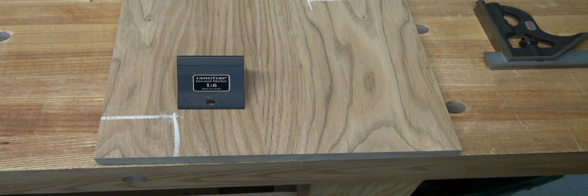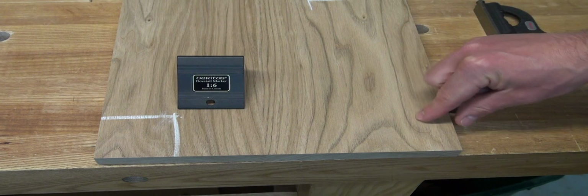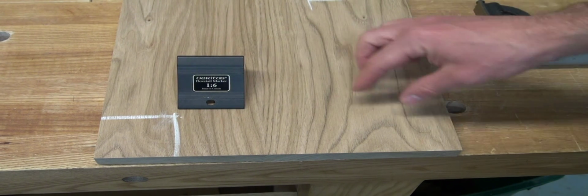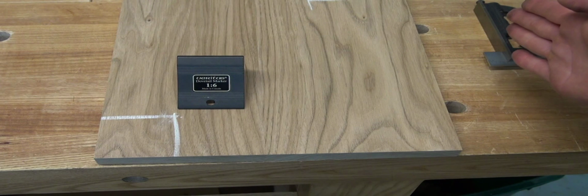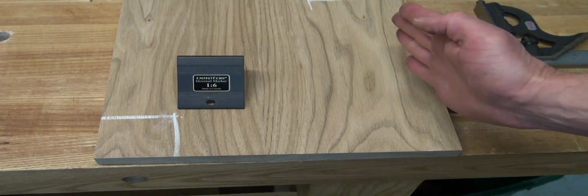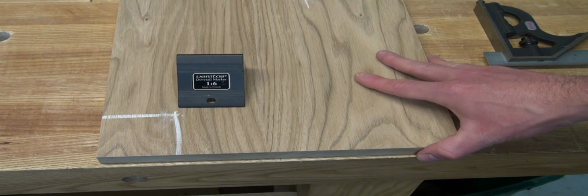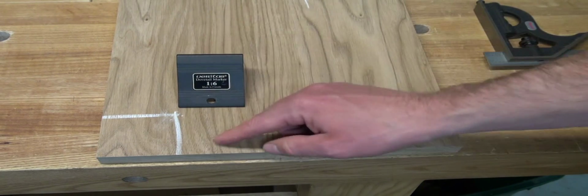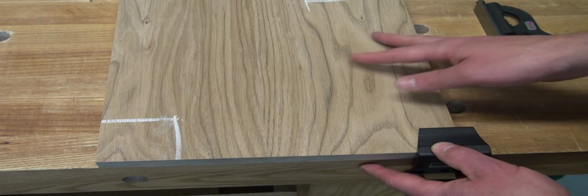An important thing to remember when you're dovetailing a case piece like this together is that typically you're going to have a rabbet around the back. You're looking at the top piece right now, and this is the back of the top piece, and you'll have a rabbet cut all along that's going to have the back boards, which will probably just be strips of shiplap board that will get recessed in there. So sort of traditionally the way to account for that with the dovetails is to end your board with a half tail rather than a pin.